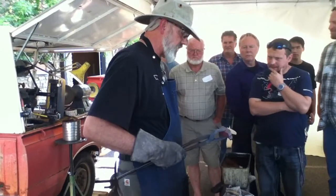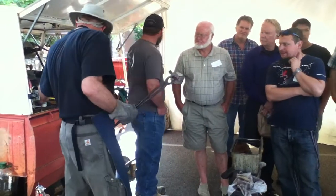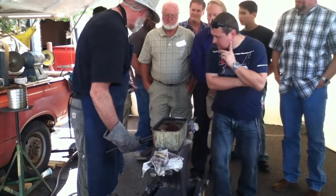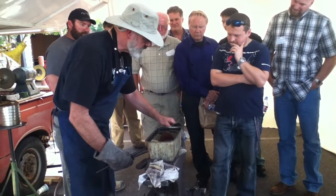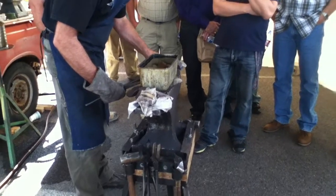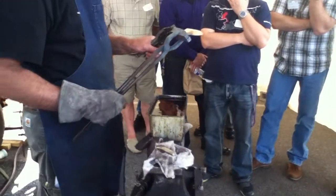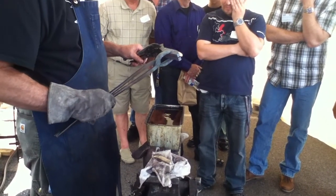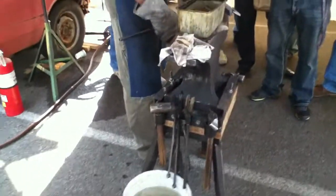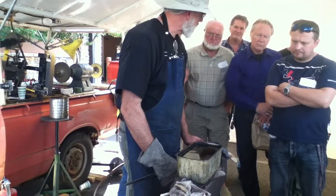Now, if there's a pair of vice grips in that bucket, would you please bring the vice grips? Vice grips are a marvelous thing. I'm getting too much straw at that spine right there and I'm going to move it. What I'm doing is watching the straw color — I was having them hunt for vice grips instead of concentrating on my temper, so I'm going to stop it right here. We're going to interrupt that temper and go ahead.